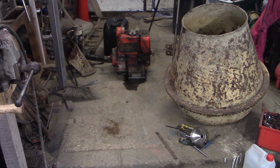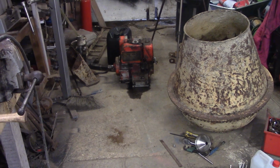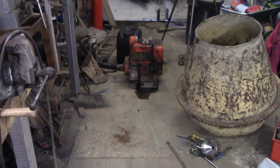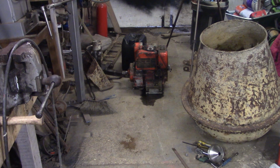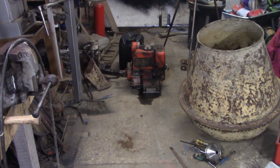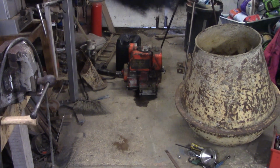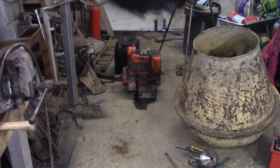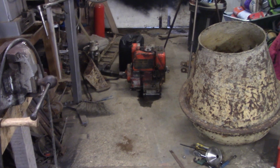So yeah, let's attack it from that angle, and if we can't get the speed out of it, I've got a little mechanical tacho we can poke on the end of there. Someone, a model plane enthusiast, gave it to me because he wasn't using it anymore. He's got an electronic one, so I've got a nice Swiss made shaft tacho that I can stick on the end of that, and we'll see what she's turning out and whether or not we can get her up to 1080. If we can, it's perfect, spinning the right direction and everything.